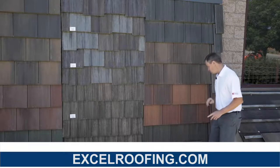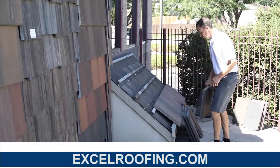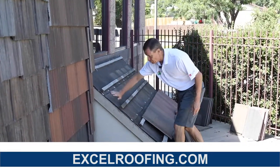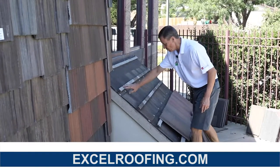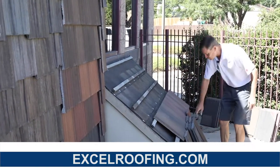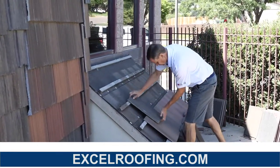I'm going to show you how we put together a tile roof — follow me over here. What we do is we strip off the old roof first, and then we put down the underlayment, either felt paper or some type of synthetic underlayment. We put battens down, which are wood strips, and then we actually hang the tile from them. We put the tile on just like this.